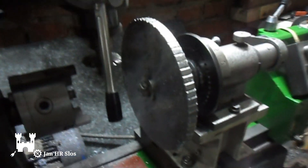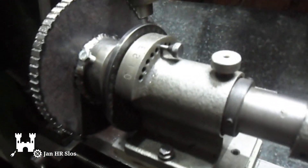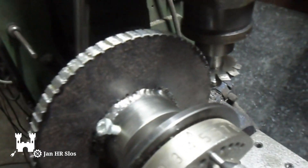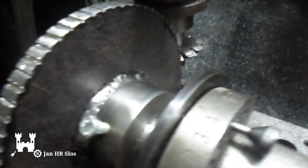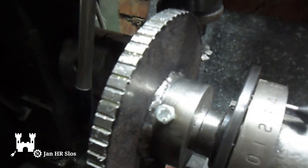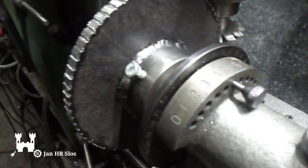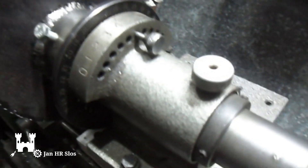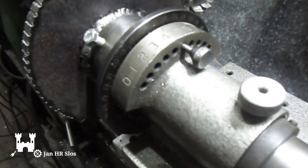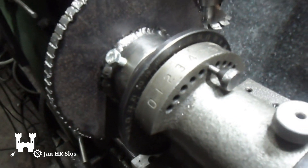This is my setup for cutting the grooves. I can only cut not too deep, because my mill isn't strong enough to cut the whole teeth directly. It's a simple indexer — 72 teeth, that's every 5 degrees.